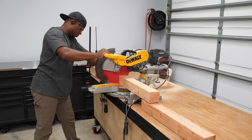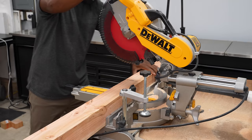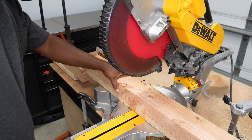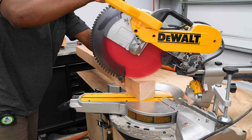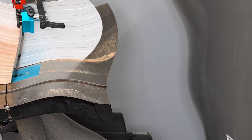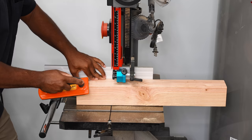The lumber I'm using here is Douglas fir and I get started by cutting the parts down on the miter saw. Majority of the parts are cut straight but then there are also parts that are cut at an angle. The nearest box store to me does not carry 2x4 Douglas fir, which means I'll have to split a 4x4 on a bandsaw.